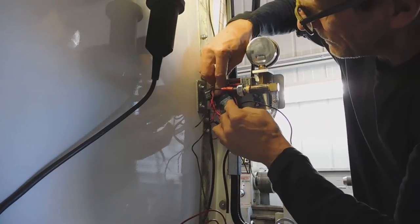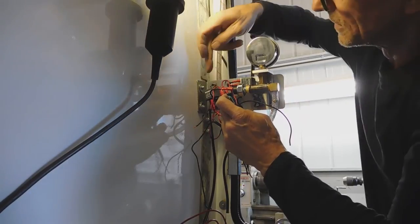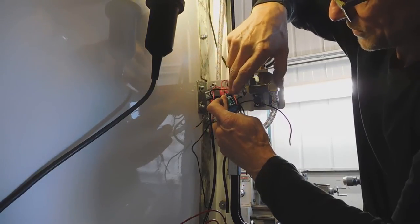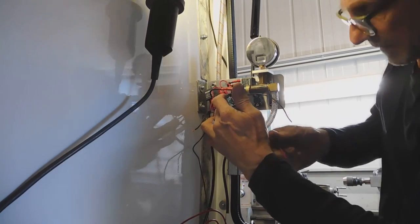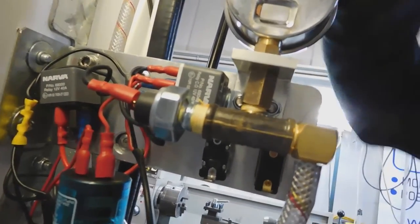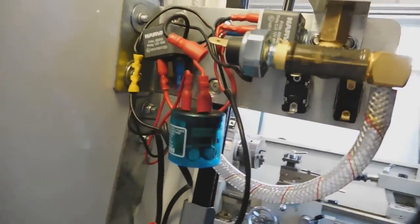The four pin relay. We've got our flasher, our door switch. So when our door switch is open, that turns on - turns on that relay, turns on that relay. Then when power is disconnected, when the pressure reaches above 3 psi, that turns that one off, which then sends the power from this one to the flasher relay and the hour meter. Power's hooked up. Switches - those doors close, so when the doors open both relays start up. So now this one's turned on and we've put power to here and turned it on. Now I'm going to simulate when the air pressure comes in and shuts this off. And there we go - we've got flashing.